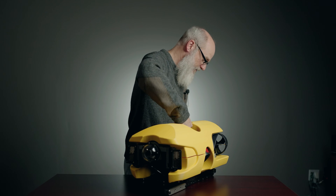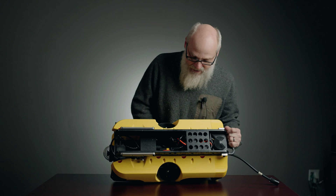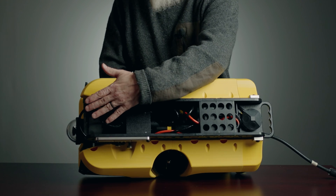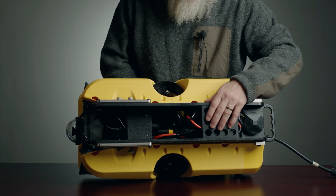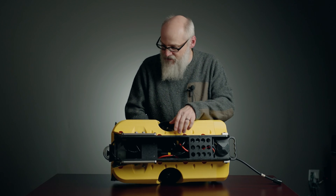On the bottom of the unit, because of the thruster layout, we have it kind of wide open. Manipulators drop right in, and it has either a fixed mount or a spring mount that we'll show you a little bit later. There's also lots of room for ballast along the holes here.